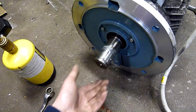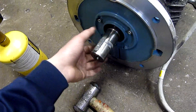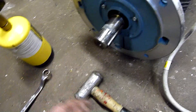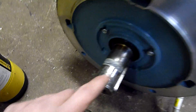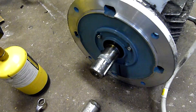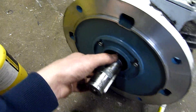As long as you don't hammer on the shafts of these motors, you won't really hurt the bearings. I tapped gently on one of the legs just to move it a little bit, applied a little bit of force from behind, and it just slid straight off. You can see the residual bearing mount compound — it smells like Loctite bearing mount. There's a V-seal there for splash-proofing.